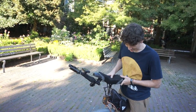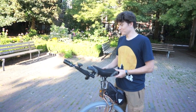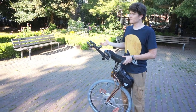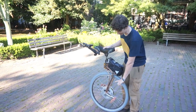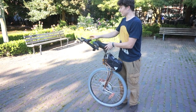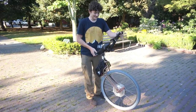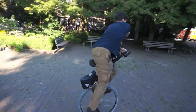One of the goals for me has always been to make a commuter unicycle — something as fast as riding a bicycle but with the portability and novelty advantages of a unicycle. With this 1.7 to 1 gear ratio I'm able to maintain a steady 25 to 30 kilometers an hour as a comfort zone speed, and my top speed will improve with shorter cranks as I gain confidence. For the most part it cruises just under the 32 km/h e-bike limit in Canada. Unlike the Schlumpf-geared unicycle hubs, you have to mount it in geared mode.